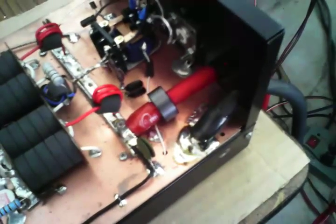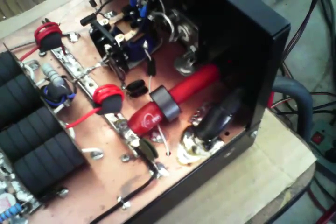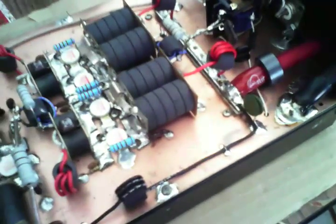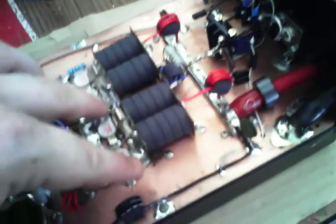Take a look at those 4-gauge connections, man. This thing ain't going to starve for power dealing with the power wires. What would have been even better — that would make this box run a little bit cooler possibly — throw that B-plus mod on this, man. Come up with at least two 16s or two 14s into a choke and go to the front of this transformer right here. It'll help it stay a little cooler, but this thing's rocking, dude.